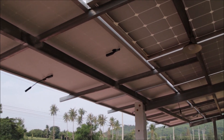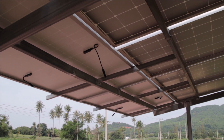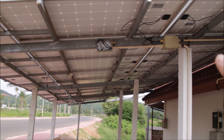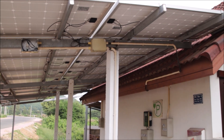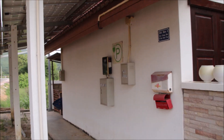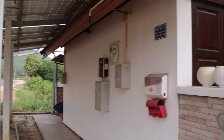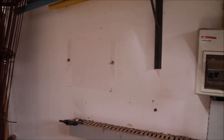Five panels in a row in series. Once this is done, the wiring from my junction box is already done because originally there was a 1500 watt string connected. The only thing missing is a DC SPD that I have to install. It goes to the utility disconnect inside, so the DC is already arriving where the small inverter was installed.